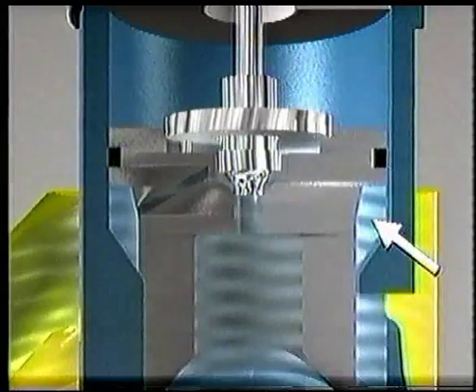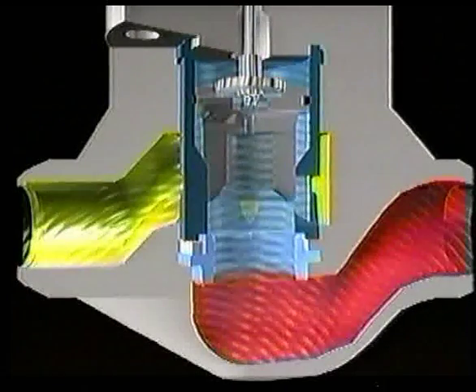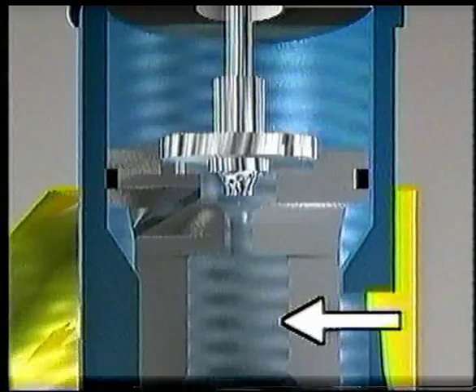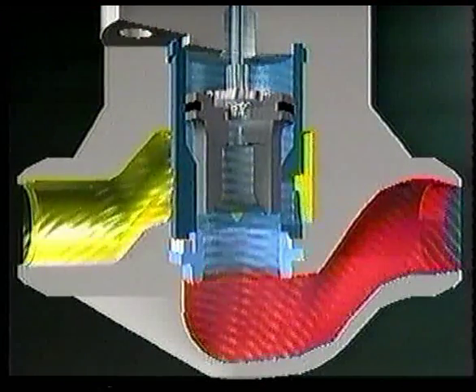When the pressure in the control area equals the pressure in the balance area plus the seat area, and the inflow and outflow rates are equal, the plug remains in position in a state of equilibrium.